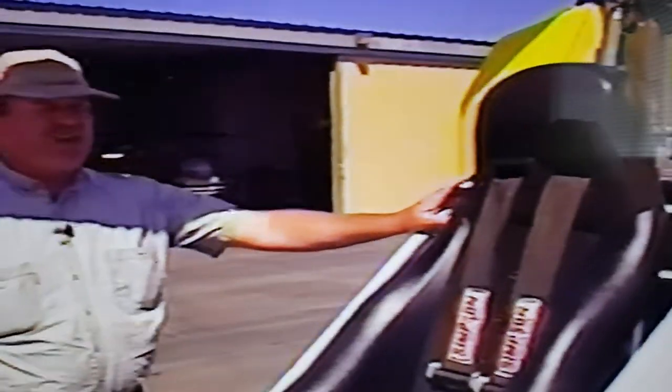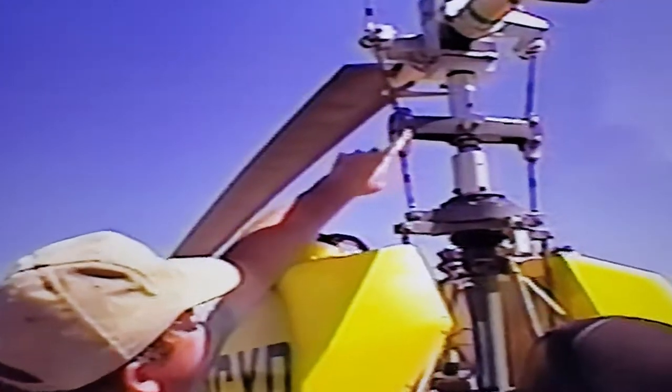That engine turns at 2750 RPM and it's transmitted into this transmission, which is a five-and-a-half to one reduction. This transmission doesn't have any planetary gears at all, so our main rotor turns clockwise if you look down from the top — rather than counterclockwise — which is French or Russian style. The transmission sits in 90-weight hypoid oil for lubrication and cooling. The non-rotating star and the rotating star of the swash plate power inputs to a balance beam that keeps everything in a box, allowing the whole system to move as a unit.